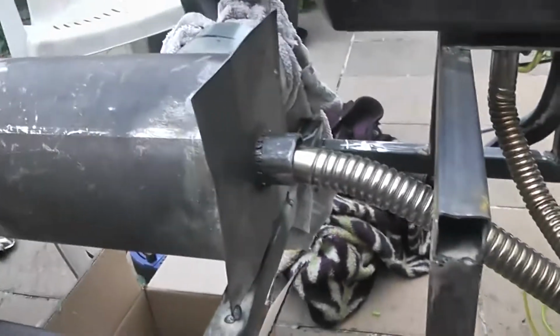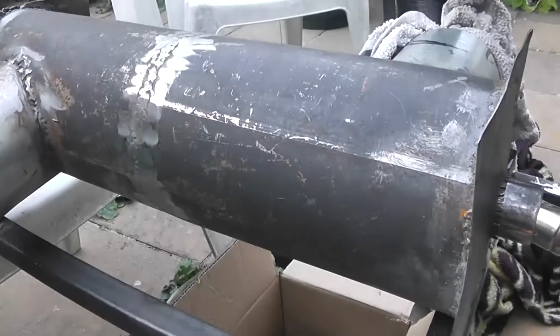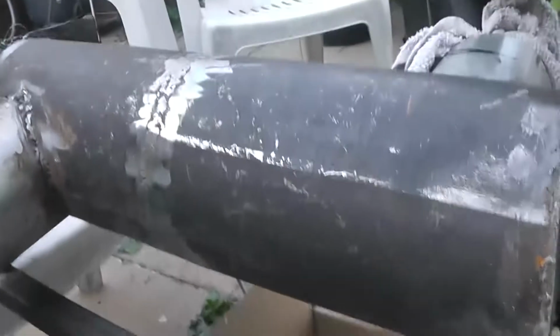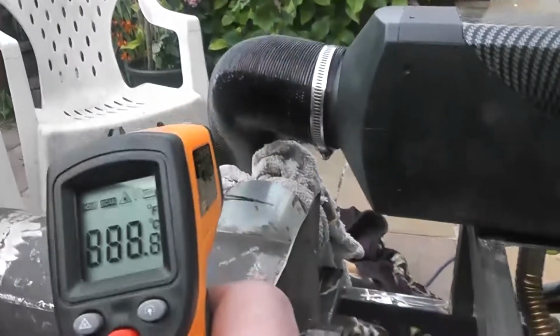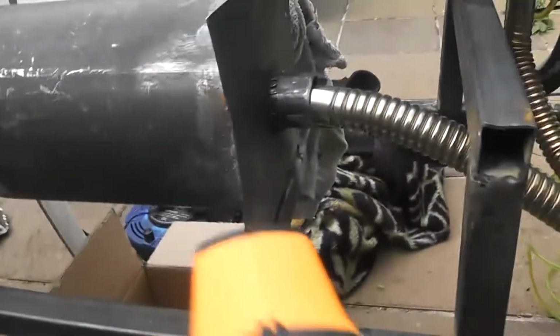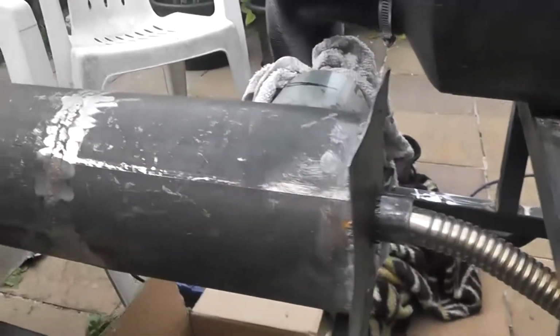But the more I think about this now and looking at it, I'm pretty sure that this arrangement is generating huge energy in here in terms of heat, but this fan is inadequate to pump enough air through it to extract that heat. Would that be a correct assumption? Because you're looking at air at a temperature of 60, 70 degrees, going into a chamber 100 degrees, bringing it up to a grand total of, we'll say 80, so that's only a 10 degree increase.